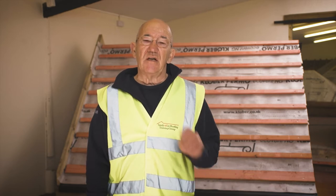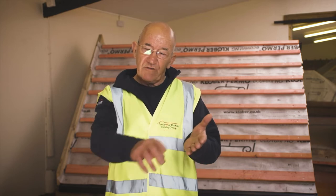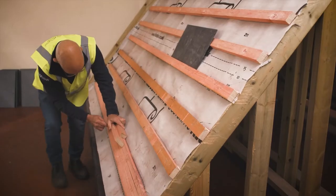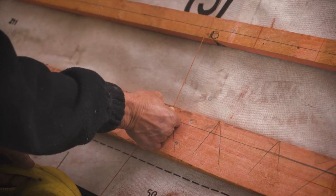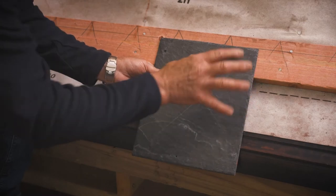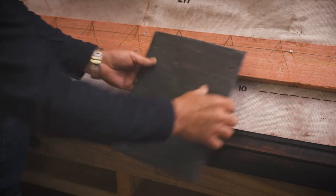We made one video which shows you how to felt and batten with all the measurements included. This video is going to show you how to mark out your roof, how to mark out the centre of your battens so that your slate is in the correct position, how to mark out your perp ends up the roof so that it keeps the joints of the slates straight. We're also going to show you how to grade your slates into thick, medium and thin so that once they're laying on the roof they should lay down flat, and we'll show you how to measure, mark and cut an eave slate so that it's the correct length.